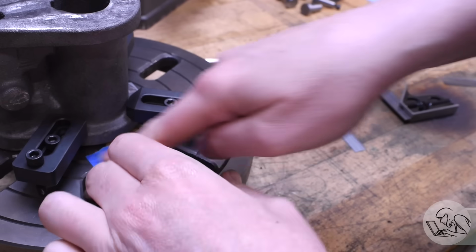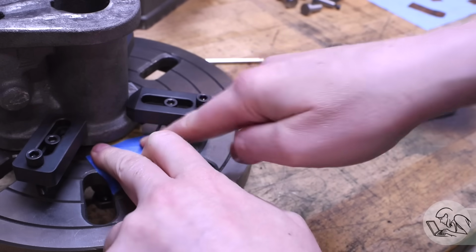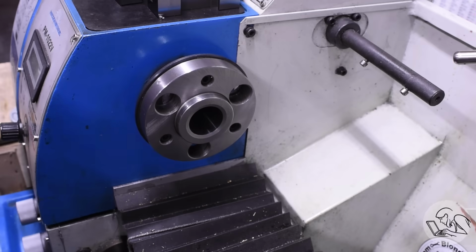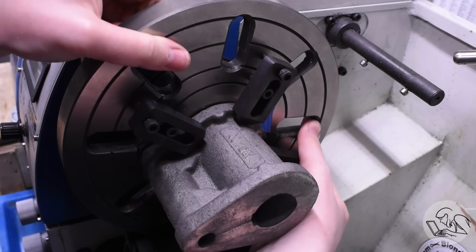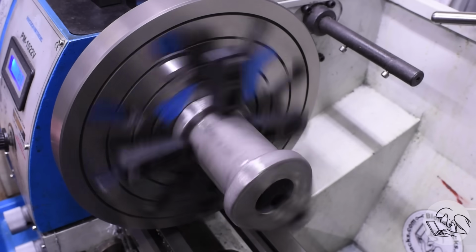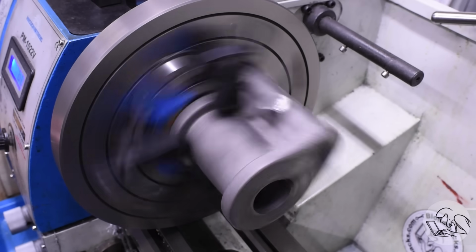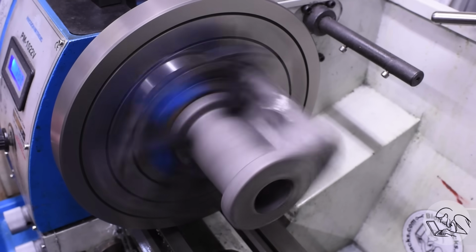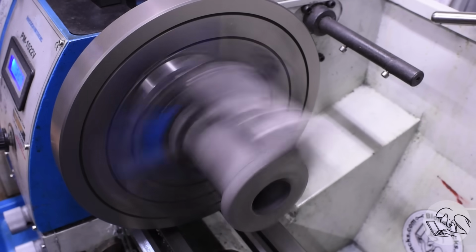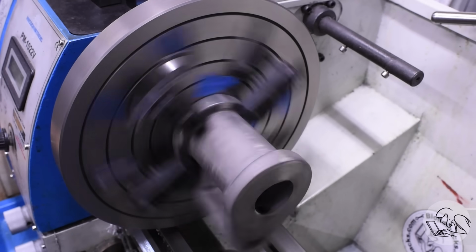And then I'll throw some tape on there to at least reduce the velocity of those shims as they fly off the faceplate into my pie hole. I had centered it up roughly with a scale, and so let's get the faceplate mounted up and see how well it's running. It should be at least in the ballpark here. And that actually looks pretty good. Of course, it's running very eccentrically. There's a lot of offset mass from the valve body there, but we'll deal with that next.